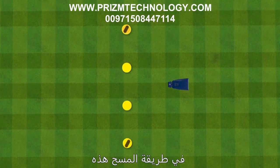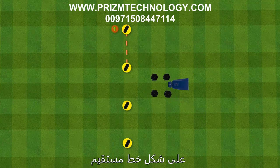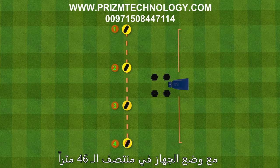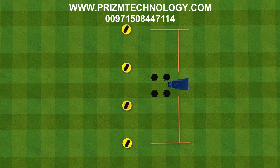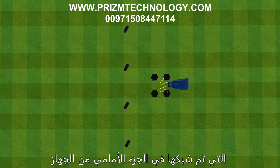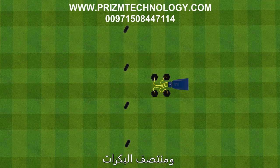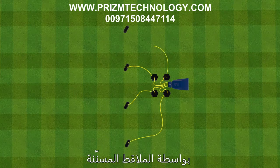Open scan method: In this scan method, ground scan probes are distributed in a straight linear form, with the device in the middle of the 46-meter overall distance between the first and last probe. Connect the short wires between the geophysical module and the center of the reels, then connect the long wires of the reels to the probes using crocodile clips.